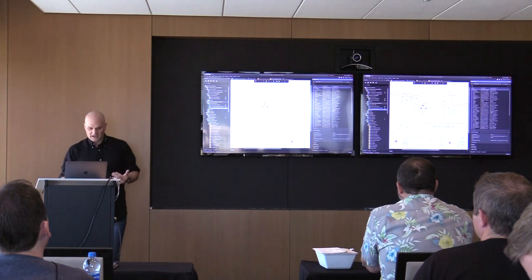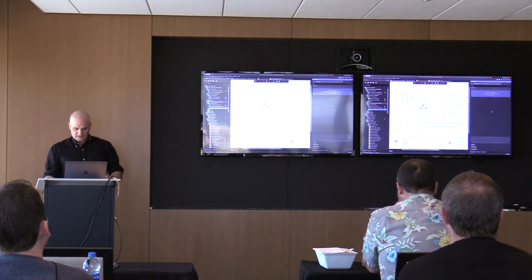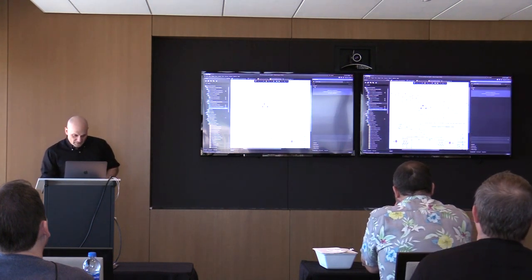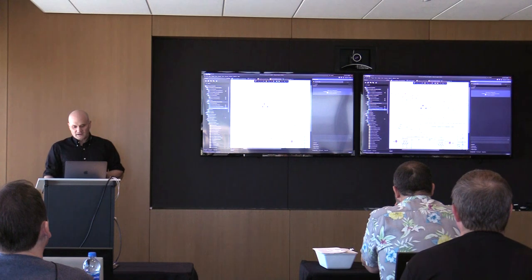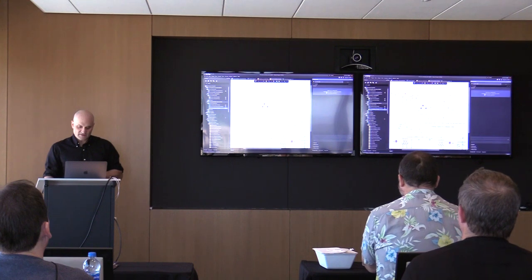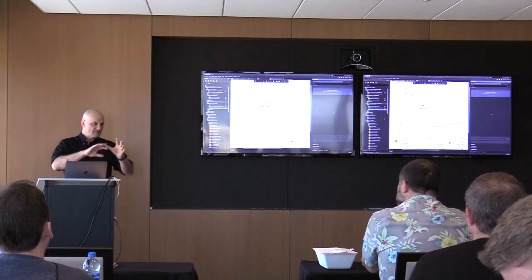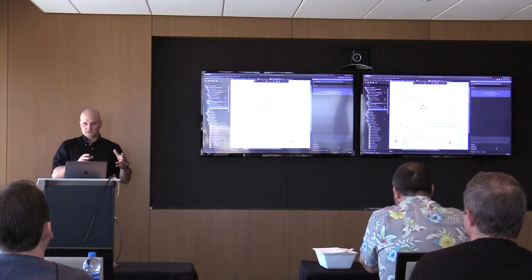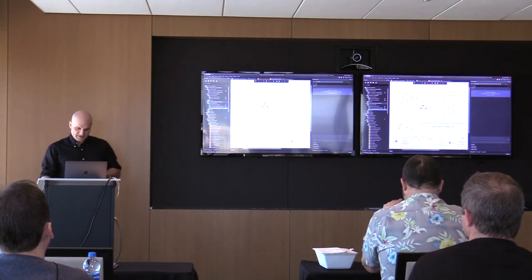If I want to find a part like LM4562 and it doesn't find the result, it says you can try part search — it's found more than 22 in the generic part search. Or I can create a new component using a simple UI for building everything you need: the symbol and the footprint. So what else is new in Altium Designer 19? Does anyone have any questions?